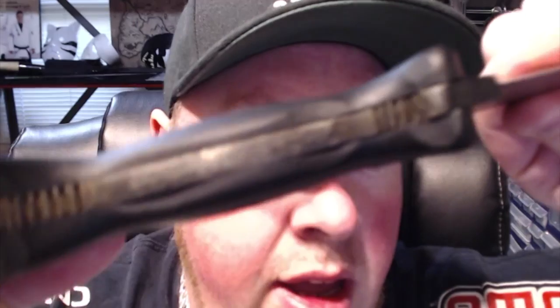As you can see, I've taken off the finish here on this part of the blade when I was reprofiling. It just made it all one. You know, it looks cool as two-tone, I guess, but I've also narrowed down the handles. I took them off of here. I put them on my belt sander, sanded them down. I've sanded down the metal around the full profile, full tang part. I've added jimping at certain points.